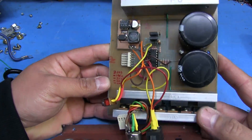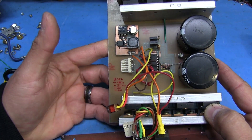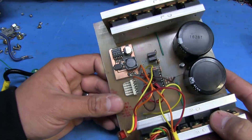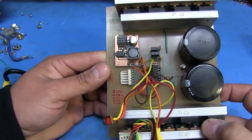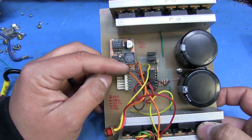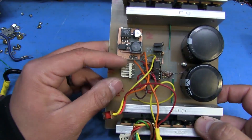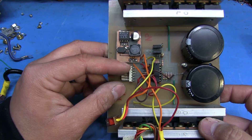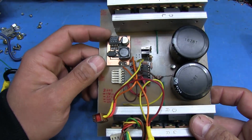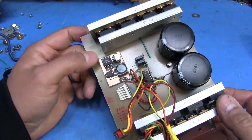The board is actually very simple. As I'll show you guys in the other video, this was actually modeled after one of those little cheap Chinese electric scooters - I just looked at how it was built and kind of designed around it. This is a five-volt regulator that I had built separately and then used as part of the board. The reason I made it separate was because I wasn't sure exactly what I was going to use when I was building this. I ended up using a little switching regulator instead because I wanted it to handle up to around 40 volts input. It works pretty well for this - it gets a little warm but it's not too bad.